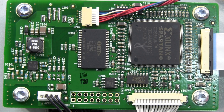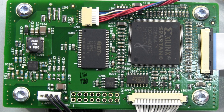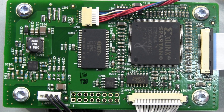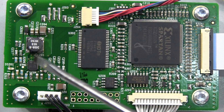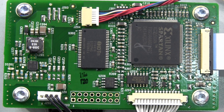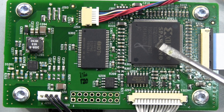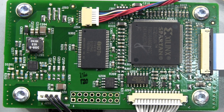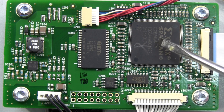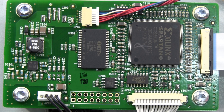Here's the display board — not terribly surprising at all that they've mounted it on a separate board. It's got a Xilinx Spartan 3 FPGA, no surprises there, with its own display memory from IDT. This is obviously a DC-to-DC converter that presumably drives the display backlight high voltage, and there's probably another DC-to-DC converter which powers the core in the FPGA. And that's probably the boot flash for the Xilinx Spartan, and not much else really.